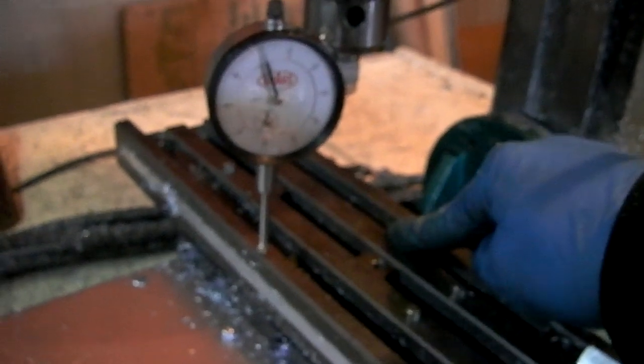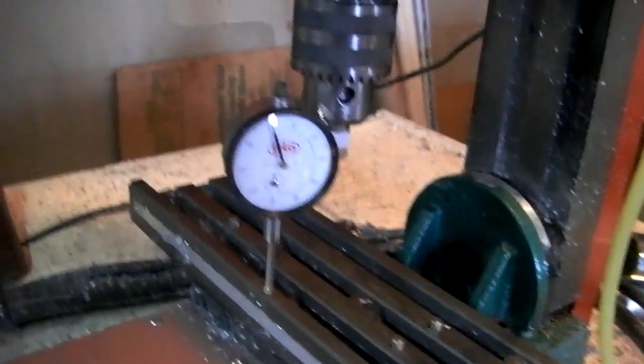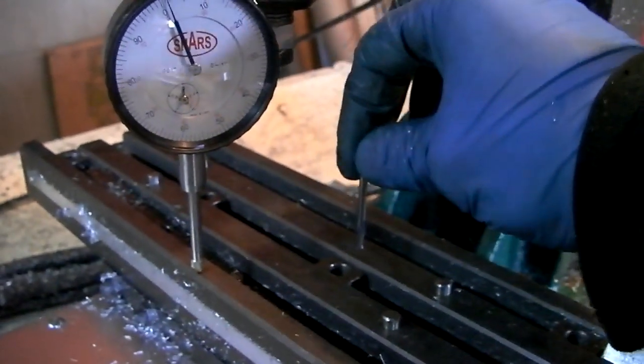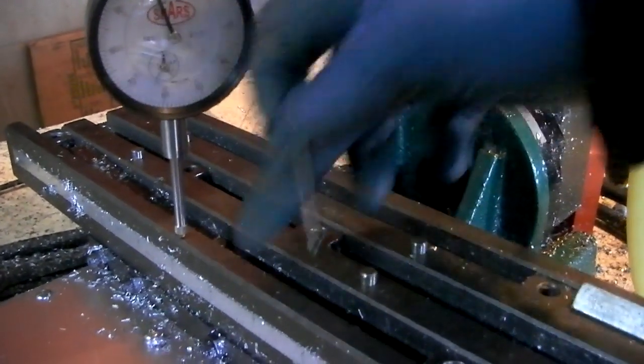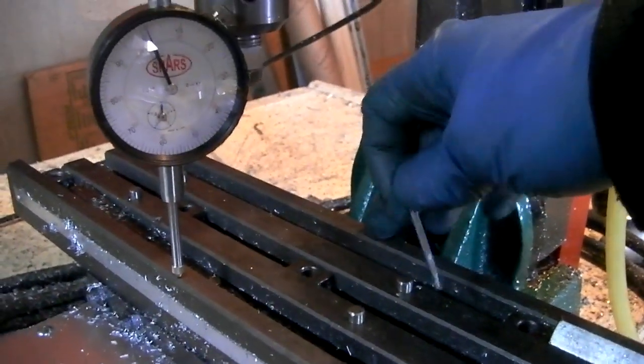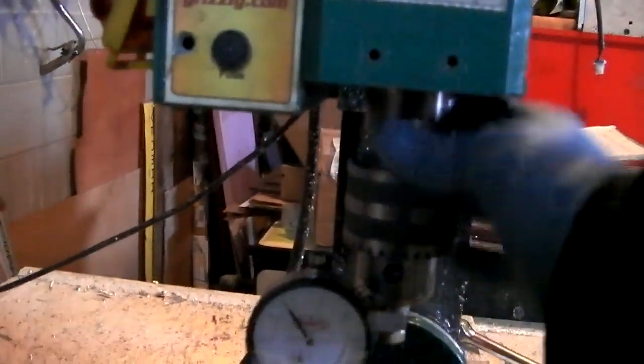That's over a sweep of three inches from here to here. You would need a tool that's three inches in diameter to notice that one and a half thou. When I use an eighth-inch end mill, one and a half thou across a width of three inches — you're not going to notice it on an eighth-inch end mill. This is going to be pretty much perfectly flat. So front to back is now perfect.